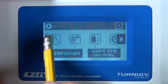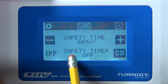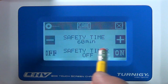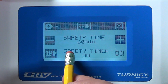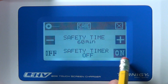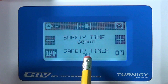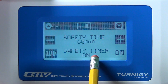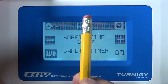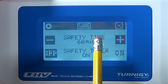You usually don't need the cycle rest. The safety timer is set to 60 minutes and it's on. Note that the UI works in reverse — if 'on' is highlighted, the setting is currently off, and if 'off' is highlighted, it's on. So whatever option is not highlighted is what's actually active. With the safety timer on, after 60 minutes it will shut off charging. If you charge with the correct capacity set, it should never take longer than an hour; if it does, the charger will stop.